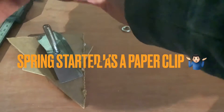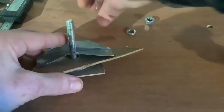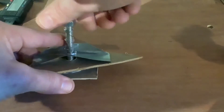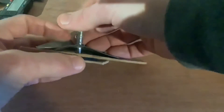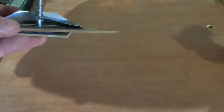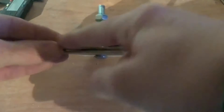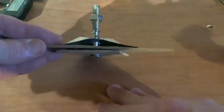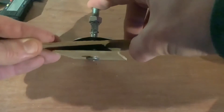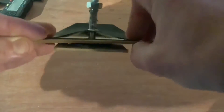We then have our spring, which has become a little bit bent. It goes on there — little button, washer, spring. The more we tighten this up, the more compression and tension we get on that spring. You don't need a lot, actually — just enough for this to hold against here. When this is sealed and the pressure on this side becomes greater than the force of the spring, it will push open and allow the system to vent through there and equalize that pressure.